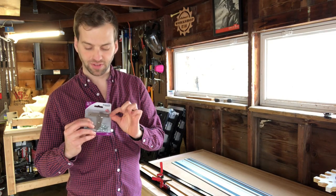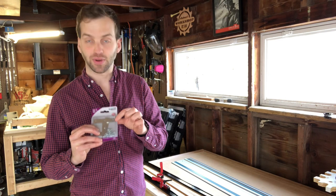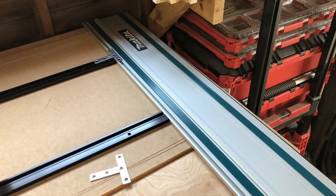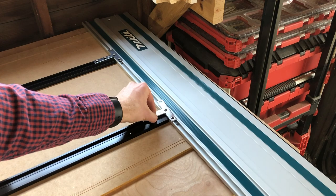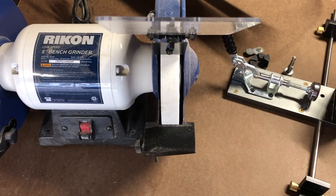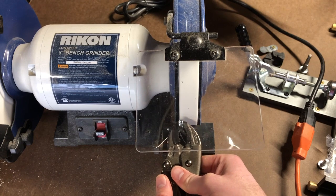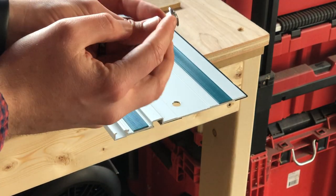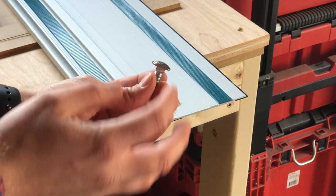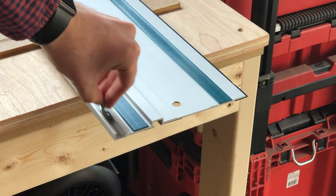For mounting, I picked up some T-plates from my local hardware store. They have five holes — the two on the edges and the two at the bottom are actually perfectly perpendicular to each other. The middle one is a little off-center but won't be used. These are made for wood screws, but the holes are the perfect diameter for quarter-twenty bolts. I have the Makita track saw, and the nice thing is that this double T-track is the same height as my Makita rail, so all I have to do is mount this T directly on top. I like to use carriage bolts and grind the edges down until they fit into the track, rather than buying off-the-shelf T-bolts, because of the extra square lip which keeps it centered inside the track.